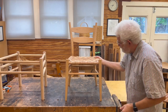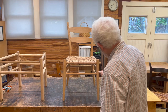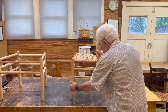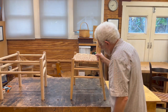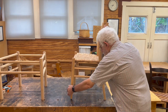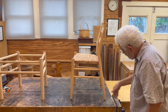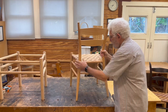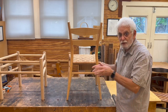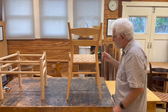This is an example of a chair with rake and splay. This one actually has a little bit of splay — side to side — which means that this rung is a little shorter than this one. Front legs are straight up and down. They may appear to be raking forward, but in the construction that's a function of having leveled the chair in the back, canting it backward, which kicks the bottom of this leg out. But during construction, this is straight up and down. The rear legs splay backward and rake backward — the rear legs rake backward and splay side to side. This is the type of post and rung construction where people start scratching their heads about how to figure out all those drilling angles.